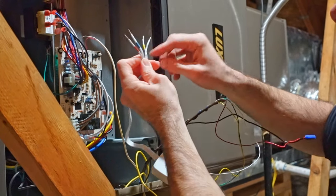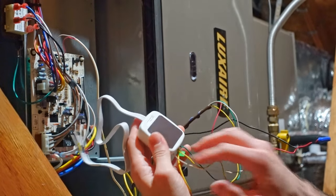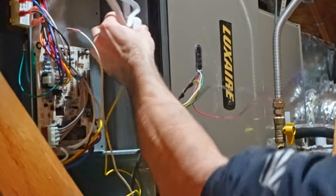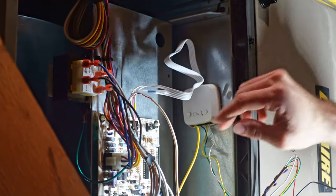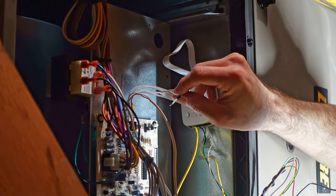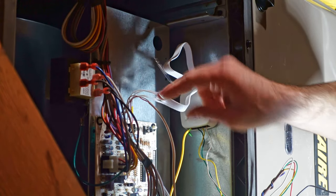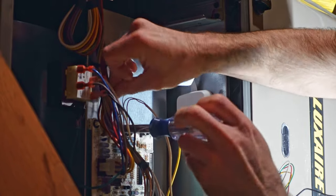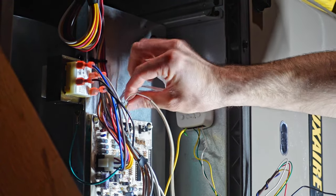I need to take all the other wires on the other end and plug them into their corresponding terminals. The backside of the PEK comes with a very strong magnet so you can attach it to the inside of your furnace. Since everything on this furnace is internal, I'm just going to attach it right here on the inside. Now you may notice I have five wires but only four plugged into the bottom — that's because your fifth one is your C wire, which is the one we didn't have at the thermostat, which is the reason we came up here. You plug four wires into one side of the PEK and get five wires out. You take the C wire and screw it into your C terminal. Make sure all your connections are secure, and I still have my two wires from the white cable in their corresponding terminals. So everything's good.